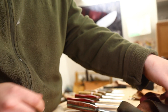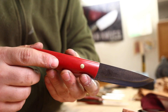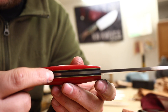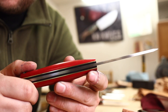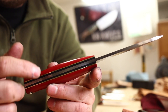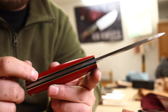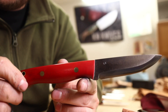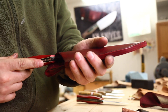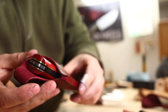And then a scandi grind tuck — this is a red G10, polished pins, all brass, and then that brass liner. We did a G10 liner because you don't want the brass sitting directly against the frame. You can mitigate it with a nice layer of epoxy, but if you have a choice, a nice layer of black G10 and then a polished brass liner in between, and then out to the red G10. And that's sitting in this dark red leather sheath — look at that hint of red leather poking out. Isn't that beautiful?